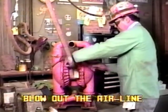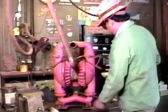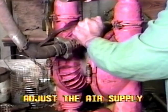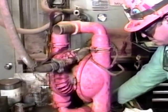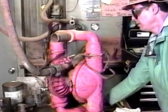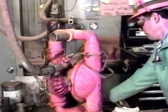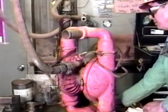Two: blow the airline out momentarily prior to connecting to the pump. This reduces mass injection of contaminants directly into the air valve. Three: adjust the air supply to the pump for the flow rate desired. The greater the air supply, the greater the flow rate. Excessive air supply to the pump is detrimental to efficiency of operation. Even though this pump is capable of operating without liquid, doing so results in unnecessary wear on the internal parts — such as the shaft, O-rings, air valves, and diaphragms — and valuable compressed air is consumed with no benefits. Excessive use of compressed air has a negative impact upon our gain share.